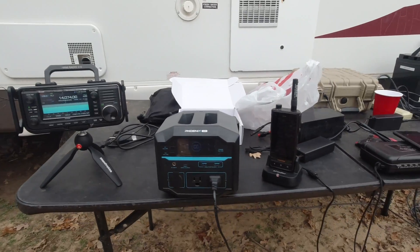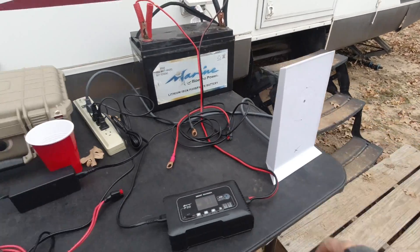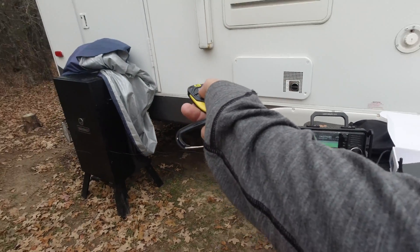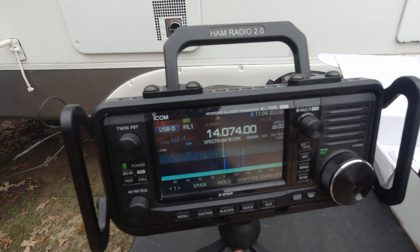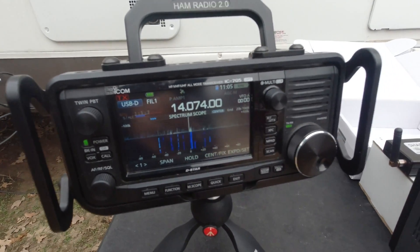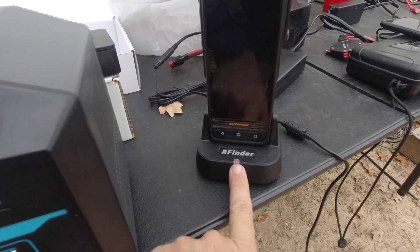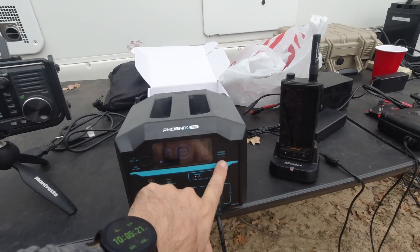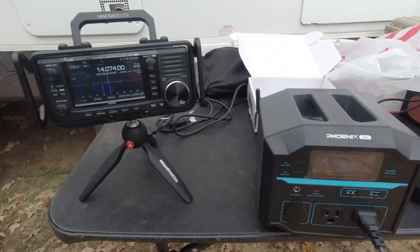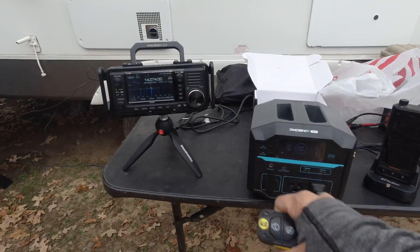When I first plugged everything up I wondered what was interfering, because I've got a lot of things plugged in here: a battery charger charging my Bio-Inno, and Starlink is on. You can't tell what's what because of the generator. As soon as I kill the generator — magic remote control — boom, there it goes away. The important thing is this thing is plugged in and charging my RFinder phone. The AC is on, the DC cigarette lighter is on, and we're not seeing any RFI at all in the radio, which is fantastic. This thing sitting next to the IC705 is RFI quiet.